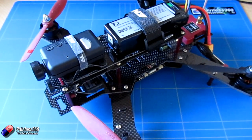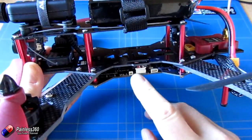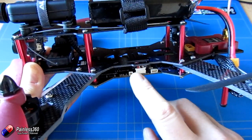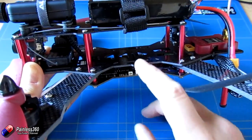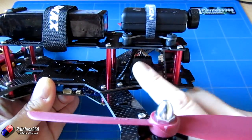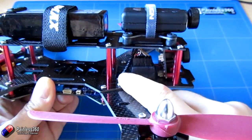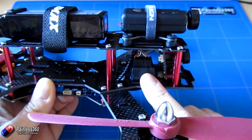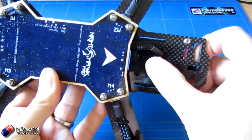Let's take a look at how the receiver is actually wired up right now. The receiver itself plugs in using an eight pin cable into the connector at the side. It goes through this in the manual — it runs the ground and plus five volts and then each of the signals in turn. That cable comes out and plugs into the radio receiver, which is this little black box here. Here are all the cables plugged in side by side, going via that braiding underneath to that little connector we just saw. The first thing I'm going to do is disconnect this — it's just held on by a cable tie, so I'll snip through that at the bottom.